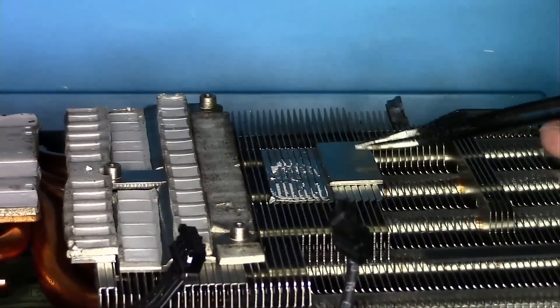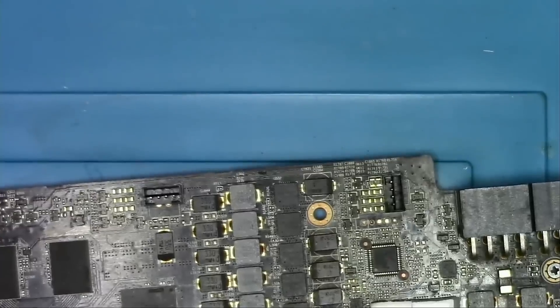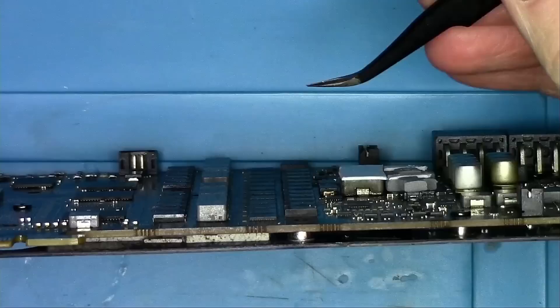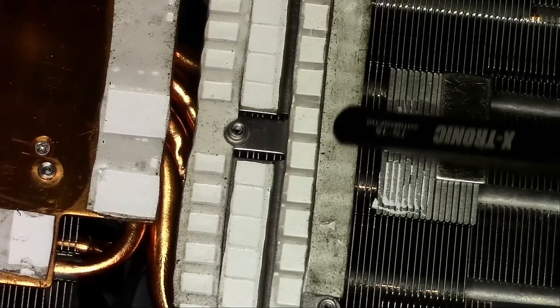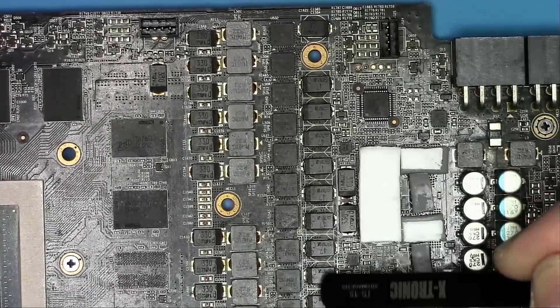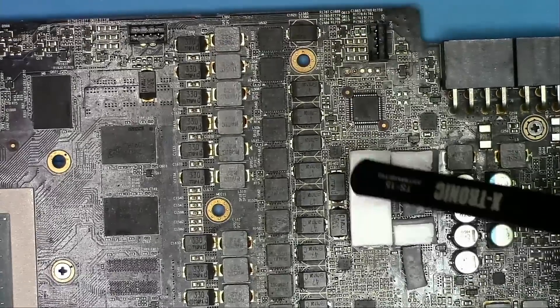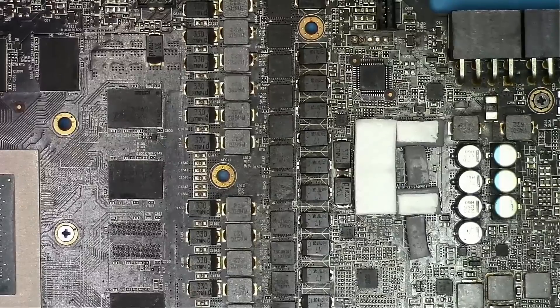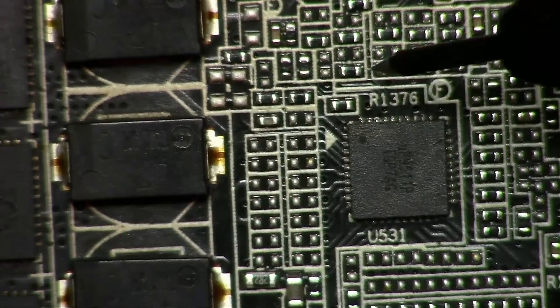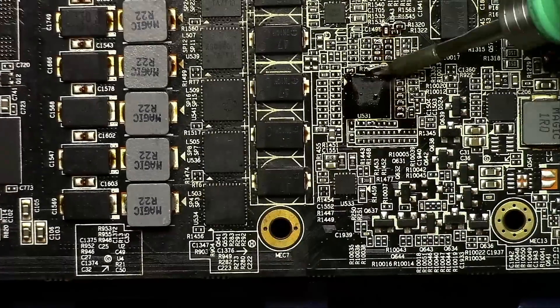If you look at the heatsink, there should have been a thermal pad to contact with the capacitors and the MOSFETs. The funny thing is that the card came from the factory with no pads in this area, so I had to add some of my own. How could they miss that? And that, ladies and gentlemen, is the reason why I don't like Gigabyte, MSI, ASUS, or anything else for that matter except for EVGA. The other cooling problem I noticed: the thermal pad on the right has a layer of dirt on it compared to the pad on the left which has clean spots — that means the pad on the right was never making any contact with the capacitors for the GPU core, which was causing them to go hot and forced the V-core phase controller to work so hard it began to draw much more power than it should have, just to keep up. Which explains why the card was using nearly 2 amps doing practically nothing. And maybe that's why these two pins on the controller are shorted out — I later replaced that controller and the short was gone.